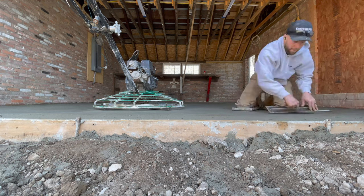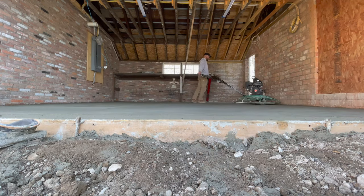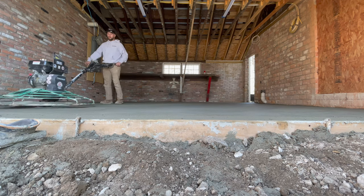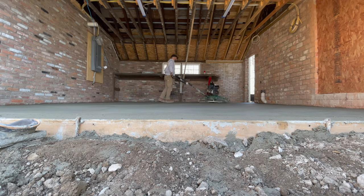This is my final hit with the machine. I came and saw-cut it the next morning, and this was one of the flattest garages I've ever poured. I don't know if that's the new 10-foot screed or if it's the 4-foot trowel machine on a one-car garage, but I'm very happy with it and I'm looking forward to using it on a big floor.